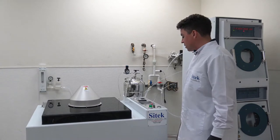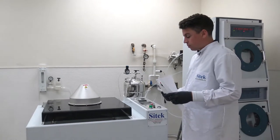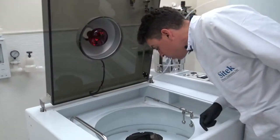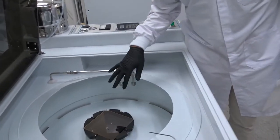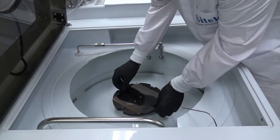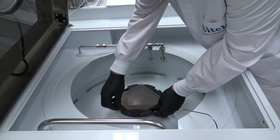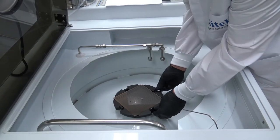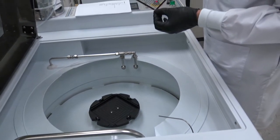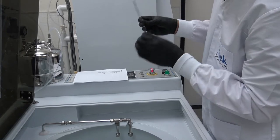The program has now ended. We're going to open the lid and inspect the chamber. We'll see a little bit of residual water left in the chamber — that's expected. We're going to inspect the surface of the mask by lifting it up. This is a scrap mask so you can see some scratches, but we're not looking at that. I'm inspecting for any water, and this mask is perfectly dry.